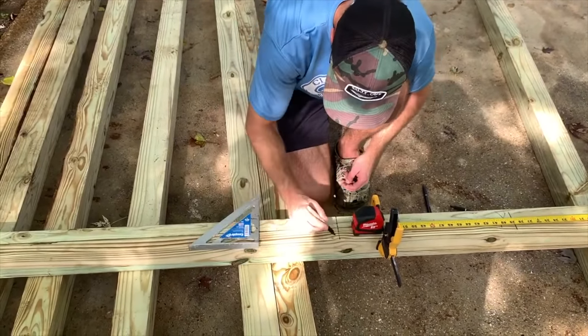Next, I took the 12-2 Romex cable that was coiled up outside my home and I threaded it through that first stick of 3/4-inch PVC conduit. After getting all of the Romex cable through, I took the piece of conduit and I inserted it into the house and sealed it with some caulk.